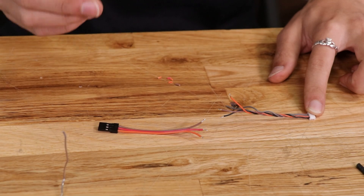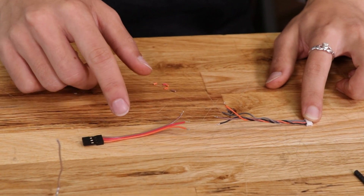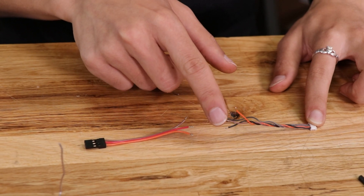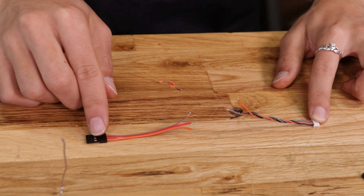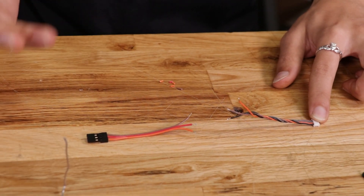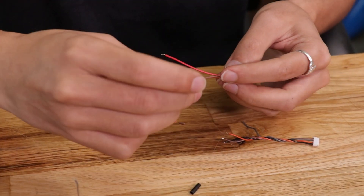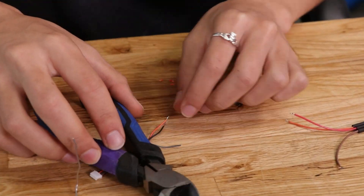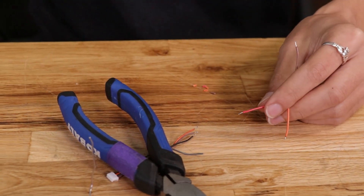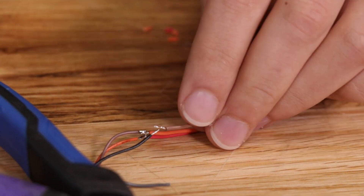The orange wire, which is the power wire for the 4-pin connector, goes to the middle wire on the servo connector. The brown wire on the 4-pin connector is the signal wire, which goes to the lightest color wire on the servo connector. Before you solder, make sure that you have heat shrink over your wires. If you have helping hands to help you solder, that's a great tool, but if not, some sort of weight like flush cutters works well for holding things in place.